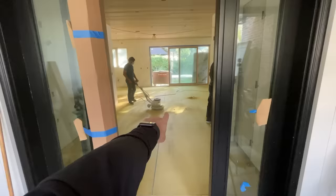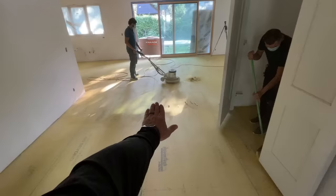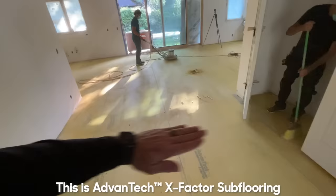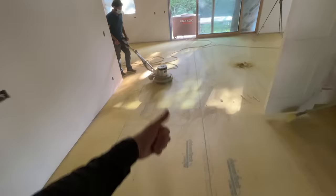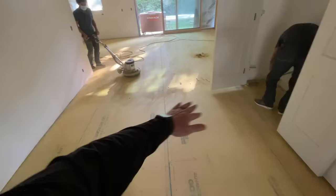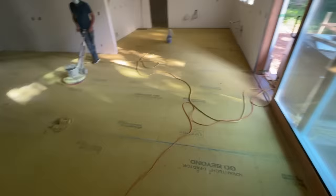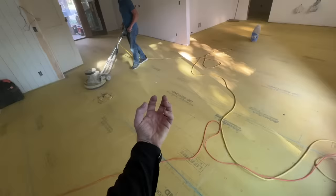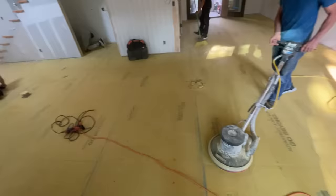Day two of the install - Wilson is prepping the entire first floor, which is almost done. Below is a concrete slab, then an inch and a half of Halo insulation, then two layers of three-quarter plywood. This Advantec runs one direction with another layer running horizontally, glued and screwed together. Wilson is running about 30-grit sandpaper to make sure everything is nice and clean so the glue has something to stick to. Look how nicely it's cleaning up.